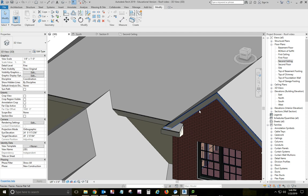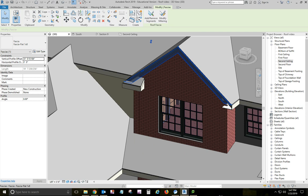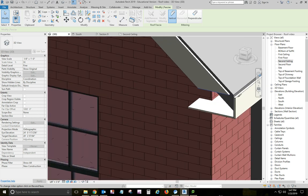After the end cap is in, you can apply the fascia as one operation. Using the same offset as on the main roof, you do a modified mitering and click on the endpoint to change it to horizontal — because otherwise it will stick down through the soffit with a plumb cut on the end. I made it horizontal rather than perpendicular, and it cuts off at the level you created it at, which will be covered anyway.